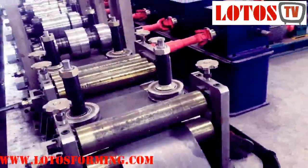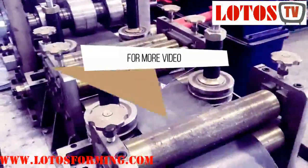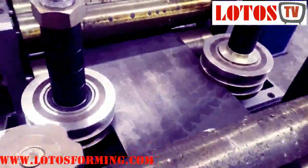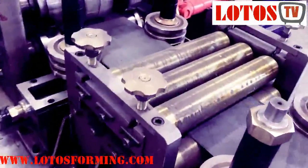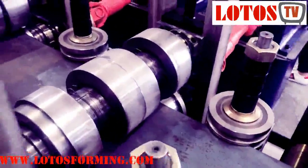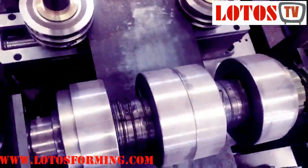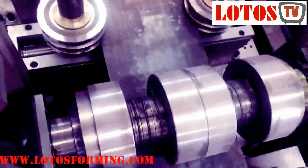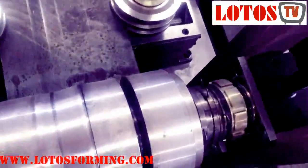The material is carbon steel, thickness is three millimeters. We will start from the input material here. These two rollers can adjust the left and right side. We have a seven-roller leveling here, again adjusting input. You can see on the roller we are using special sleeve spacer bushes to change the size later.